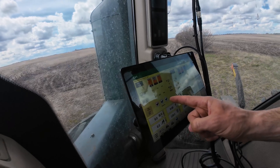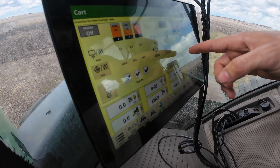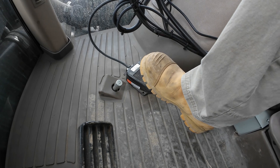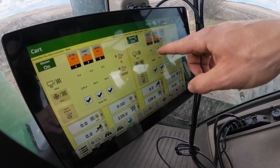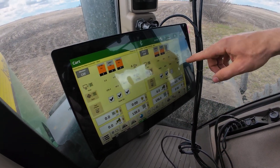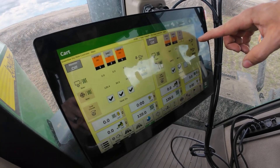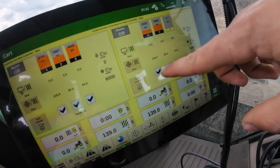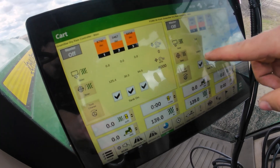We've got it set up with a tow-between label for the front P1060, and this one is the tow-behind P1060. We can see them both on the same page. When you hit your foot switch, your master comes on while we're seeding. These are my set rates for each tank, and this is what's actually getting put on while we're going. I can turn the master off — you can see it off. I have my fan set range for the product and my actual fan speed when we're going. We can turn whatever tank we want on or off with these check marks. Tank three is empty right now, so I have it turned off and just running full rate out of tank one.